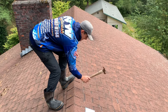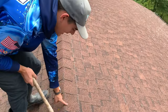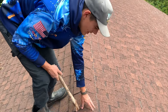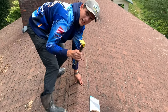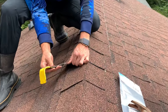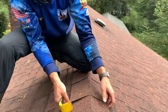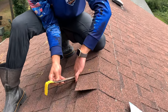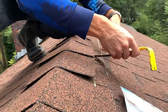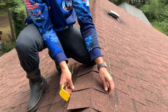I found the truss right there — I hear a more solid thud. So I'm going to go ahead and take these two shingles off here. We're going to place the anchor right underneath these shingles and put them back on. I'll get my flat bar and slowly — you have to be really careful here — lift these sides up. There are nails on every side, so we'll use the flat bar to pull up two shingles, two roof caps. Once they're up, we should be able to slide them out, just like so.